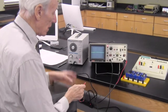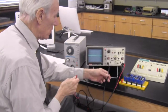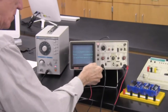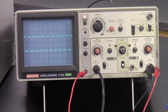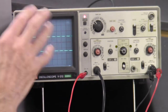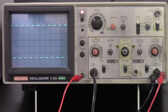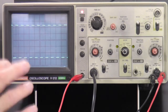The first thing you're going to do is check the calibration on the screen. I'm hooked to channel 1, so I make sure this is set at channel 1 — I'm looking at channel 1. I'm going to hook this to the tab here and get that very confusing-looking pattern. We talked about how we can freeze this with the little knob up here. We need to switch the trigger to channel 1 so that we're triggering on channel 1.